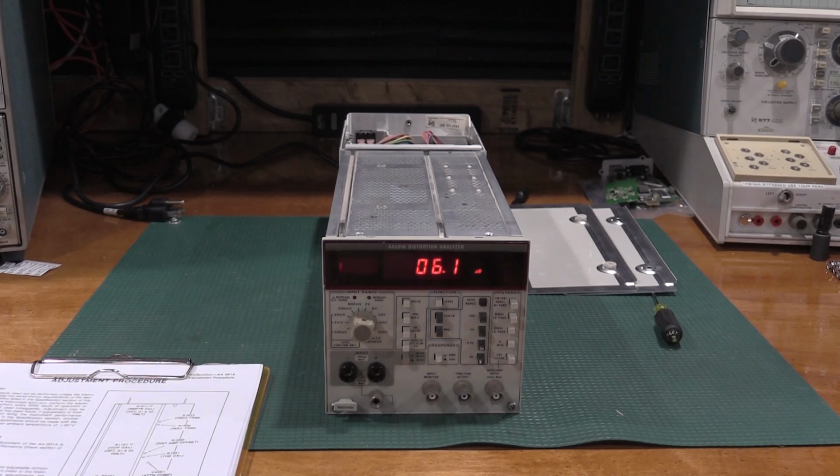That's probably what I'll be using to do my calibrations and adjustments from now on with these 500 series plugins, as long as you only have a 2 slot or smaller and it's not high current, because the 502 doesn't have the high current spot. I'll use that for powering the plugins I'm working on, because it gives me a lot of access and I can rotate it and do everything I need to do for the adjustment.